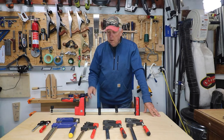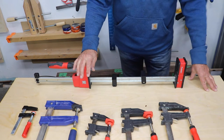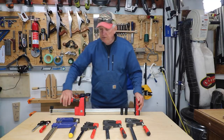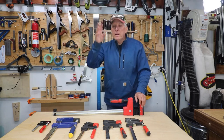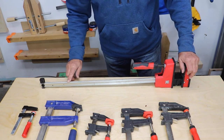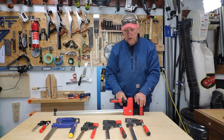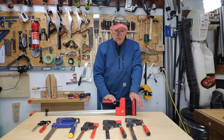A lot of people I've seen talk about being frustrated with their panel clamps, and I was too. I finally got so frustrated I stopped and said, why don't I study these things and see how they're actually supposed to work. Here's what I've discovered: first of all, keep them clean. Before I use them for a glue-up, I grab my can of car polish and quickly polish my bars — that's to try to keep glue from getting down into the groove, and if glue does get on it, it can come off fairly quickly. Keep it tuned up, keep beeswax and silicone on it so it twists easily.